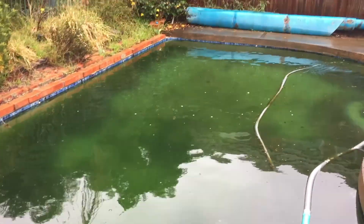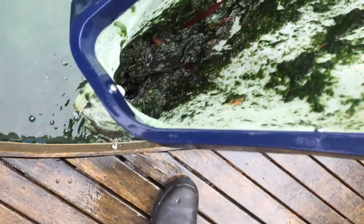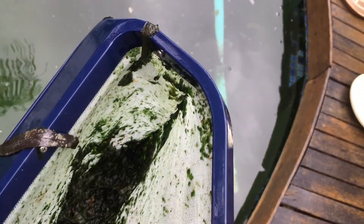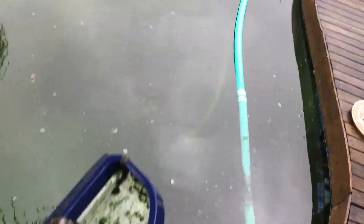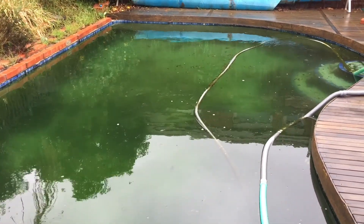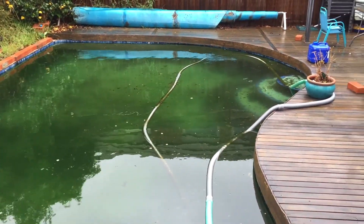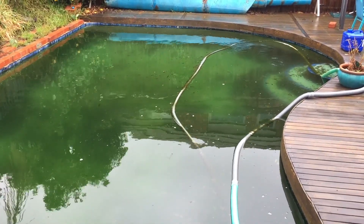Still going with this pool and you can see it's getting better with just a little leaf raking. What it looks like up close is what I'm leaf raking up off the bottom — if I'd gone straight in with chemicals, that would just soak all the chemicals up. The more of that I can get out the better. As I'm scraping the bottom there's also air coming up because there's plant matter with air trapped down there — it's quite thick — and some of it is floating up on the top again. I'll scrape all that off the surface and then add the chemicals and give it a brush.